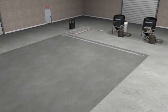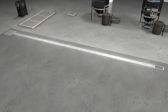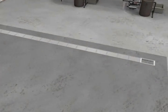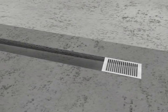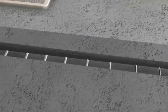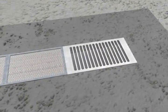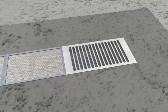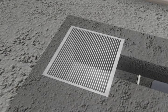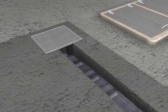For applications with lighter solid loadings, such as over-the-road equipment or for a second stage wash system, a smaller trench drain is recommended. This trench drain is typically sloped from one end and may have small, uniquely designed baffles placed in the bottom to enhance solid separation and create a dry trench environment. A mesh screen may also be required to filter out fine solids and debris. A catch basin installed at the deep end of the trench drain allows the trench to dewater and minimizes standing water within the trench system. Clean out is easy and a shovel can be used to remove the settled solids from the trench.